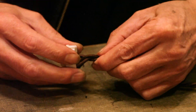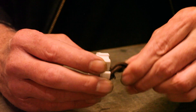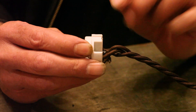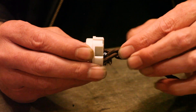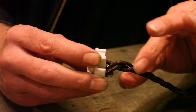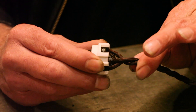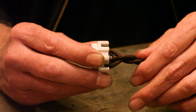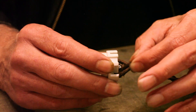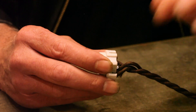We're just going to tidy up this end here. The braided cable is nice and tight, and you'll notice that the earth terminal is a little bit closer to the length of the cable than the active and neutral - and what this does is creates a little bit of a loop in the earth. That's actually a safety feature. What that means is if this cable becomes under stress and is pulled and you may pull out cable connections, it makes sure that the very last cable to come loose is the ground or earth. So even if there's a stray active and it comes in contact with the body of the lamp holder making it live, that would short to earth straight away. The earth should be the last connection to be destroyed.